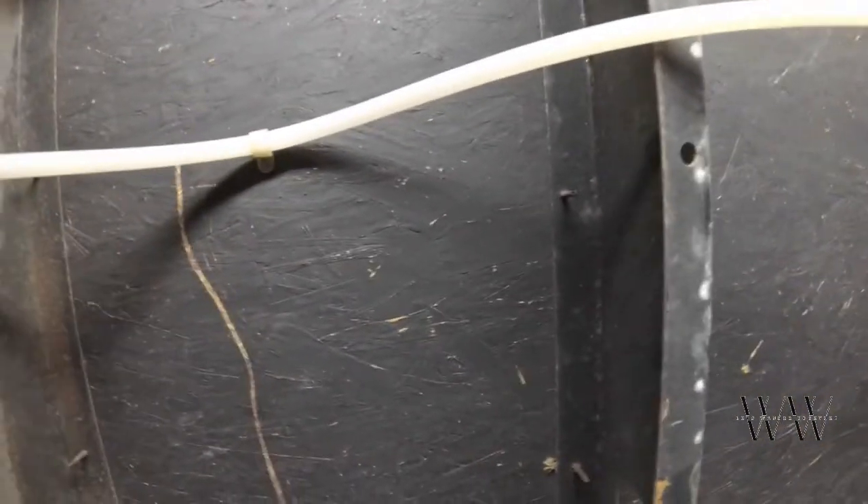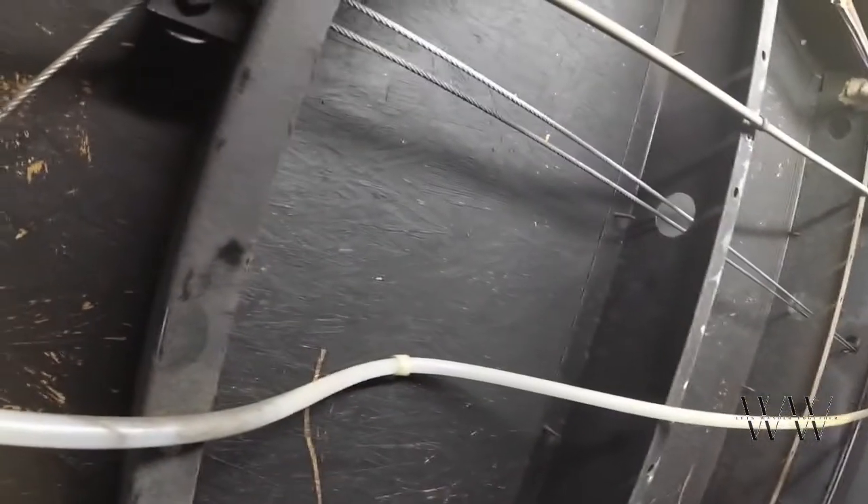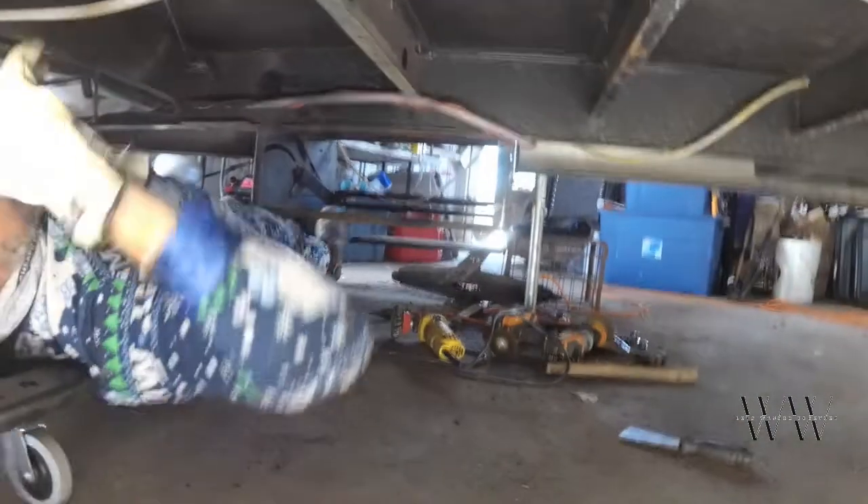One of the reasons to prep - I barely touched that hose and I did not cut through it, and it's been riding right there. You can see that - it's riding right here as well, which is not good. None of that seems correct, so we're going to fix all of this hose and make it correct before we put it back together. We may go ahead, since this is a 2007, and run a brand new hydraulic lift line. I haven't decided yet, but it's not that expensive - that way it's done and we know we've got a good line with no issues for years to come.